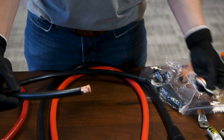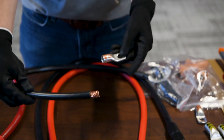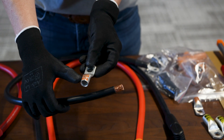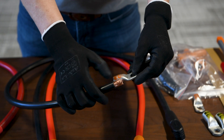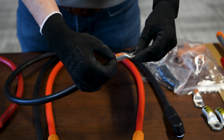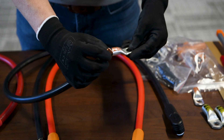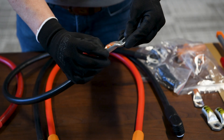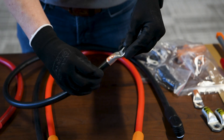When you're using two-aught wire as we are, you can use the same size two-aught lug. It should fit directly over the wire. We have gone ahead and stripped our wire by measuring the size of the lug. You notice it starts to go in, so we measured to where we should strip based on where it starts to fade in. We marked it and stripped it, and then you will want to carefully make sure all of your wires can fit inside of the lug, making sure that all of them fit right inside. If any of them start to stray outside, you'll want to start over and carefully push them inside with the lug until they fit.